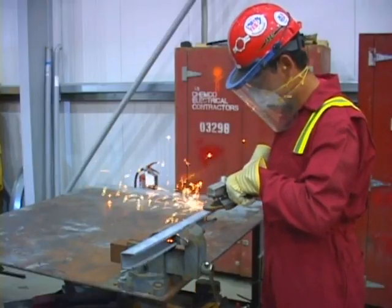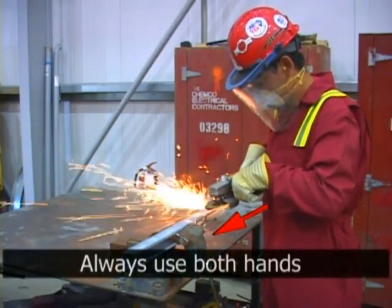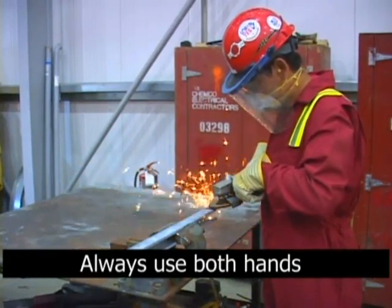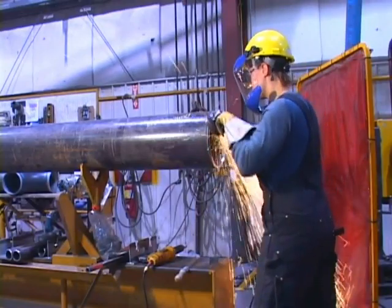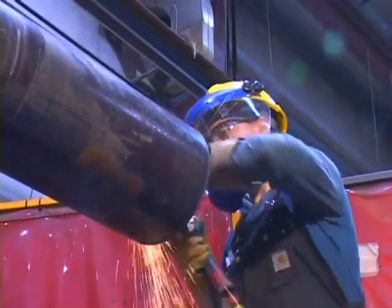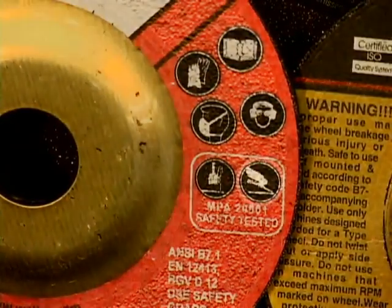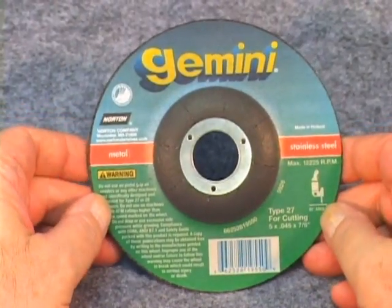Always position yourself or move the material so the working end of the tool is pointed away from you. Hold the grinder tightly using two hands — using the handle gives you better control and helps prevent dangerous kickback. Use short, even strokes with only enough force to work the material. Too much pressure makes the disc inefficient and could cause damage to both the disc and the grinder. The sound of the motor will signify when you're using too much force — an overworked motor will sound strained with an obvious drop in tone, pitch, and speed. There is a manufacturer's recommended angle for the best performance with each type of disc — check the disc specifications before beginning your job task.